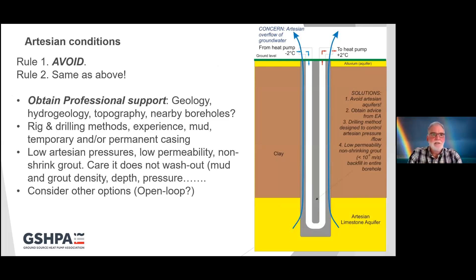A word about artesian conditions. Artesian conditions mean that groundwater in an aquifer is at a pressure high enough that if you drill into it, the water within that aquifer will flow up the borehole and flow onto the surface. Typically an artesian aquifer will be an aquifer sealed below a layer of clay, and the groundwater will quietly sit there and move with the local gradient until you pierce it with a drilling rig. As soon as you pierce it, the water under pressure flows up the borehole and will flow pretty much forever unless you do something about it.